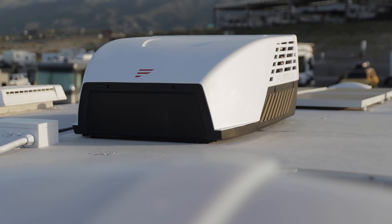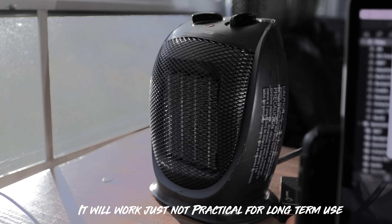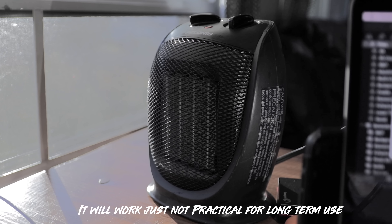It's not what it's built for. But when you go out boondocking you're usually trying to conserve power — it's not a race on how much power you can use at once, it's about stretching the power you do have. So you're going to be mindful of those things already. You're not going to be trying to run the AC on a system like this, and you also wouldn't want to use a space heater. It just doesn't make sense on an inverter setup in an RV — same with a power station like this. The point is you're able to use those devices and have functionality inside your RV, so the inverter output matches what would be useful inside.